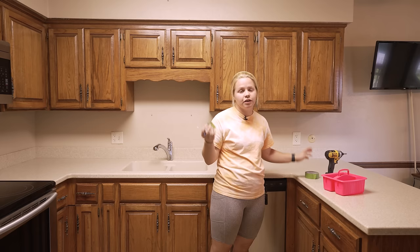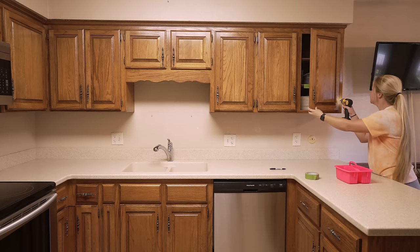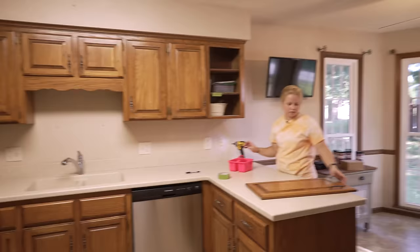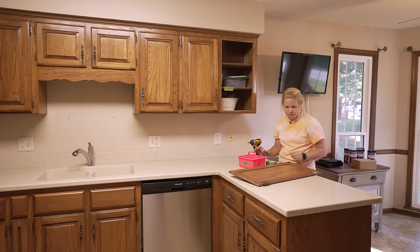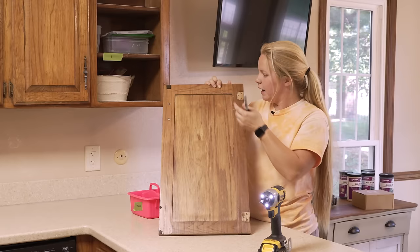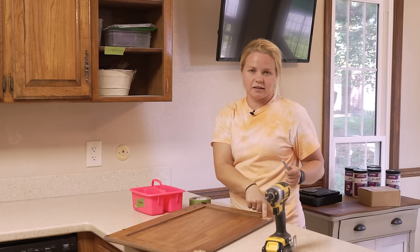I want to be very informative for you guys, so in case you are interested in redoing your own cabinets, you'll have a little bit more knowledge after watching this video. I'm keeping the screws and the hinges in a container and labeling the doors. For labeling the actual drawers or doors, what I like to do is write inside where I took the hinges off, because it's okay to avoid painting that area since the hinge will be covering it up. That number will match so I'll still know where that door belongs.